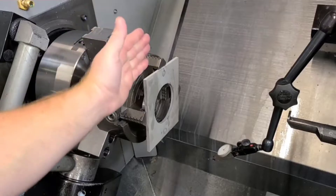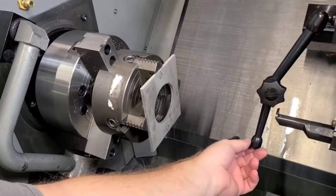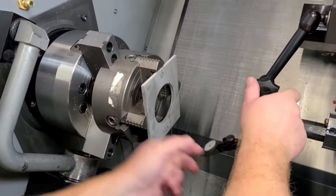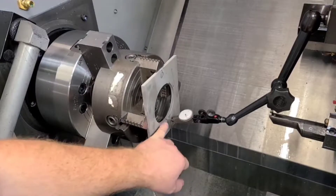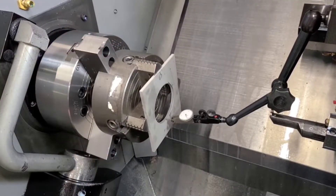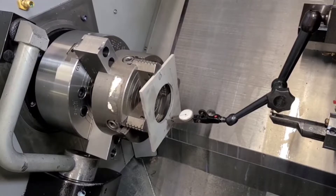The spacing ring is good and we know the part is running true with the chuck on the face — no run-out side to side. We're going to place our indicator, go to jog mode on the machine, and put the indicator on the bottom. I like to tighten the high points. This is a water jet blank, so we're going to go on the smoother side where there's less surface variation. We'll jog up and down in the X-axis — make sure the indicator stylus is as close to parallel with the part as possible, or you can get cosine error.